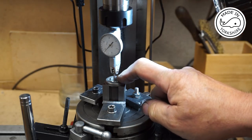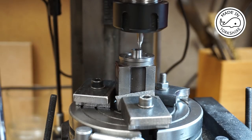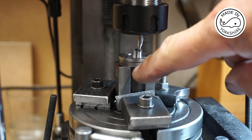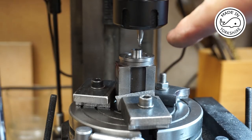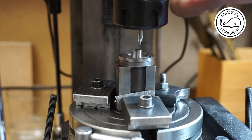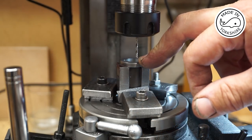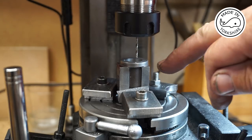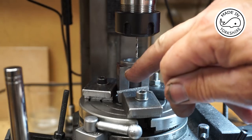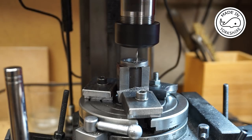I've managed to centre the cylinder and positioned the first hole to be right at the bottom. I'll centre drill, then drill to 2.1mm and then tap. I'll drill to a depth of 6mm for these holes — that'll give me plenty of clearance when cutting threads. That means I'll come through here on one hole, but I should be okay on the others. I'll double check, but I think we'll be OK with 6mm — actually I'll settle for 5mm and see how that goes.